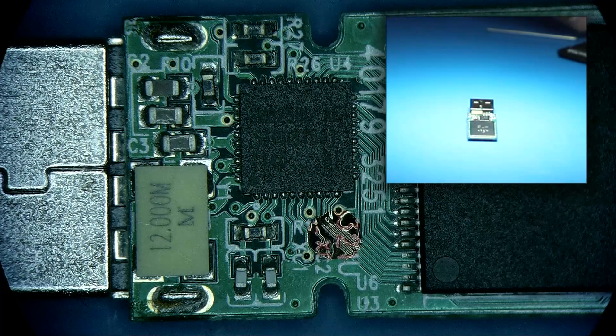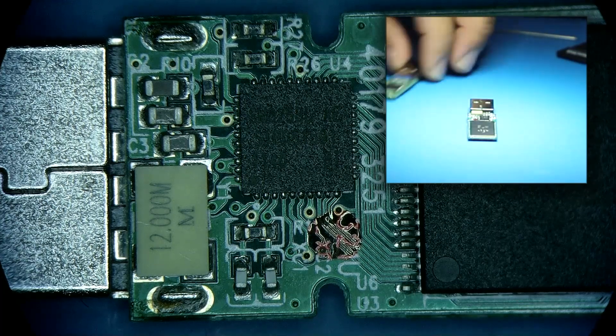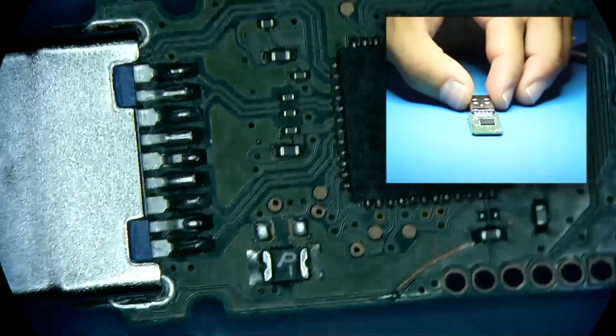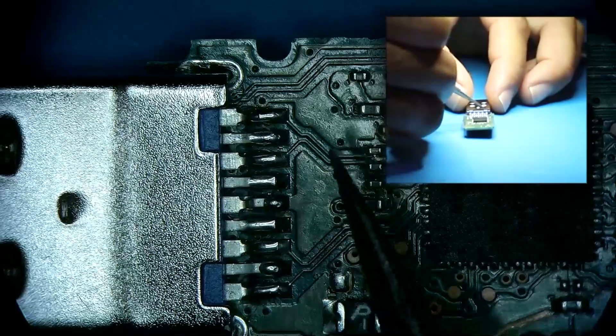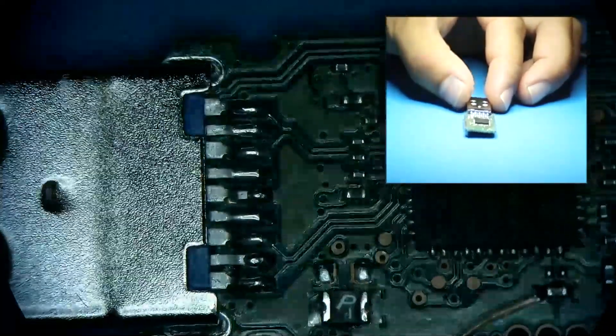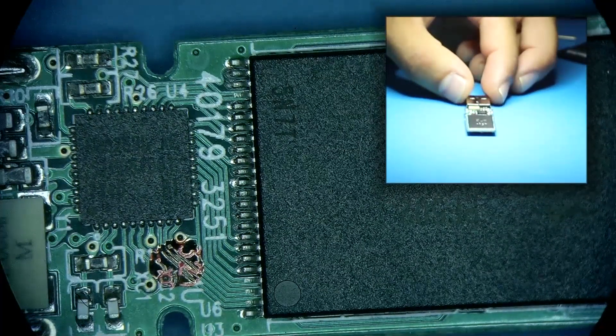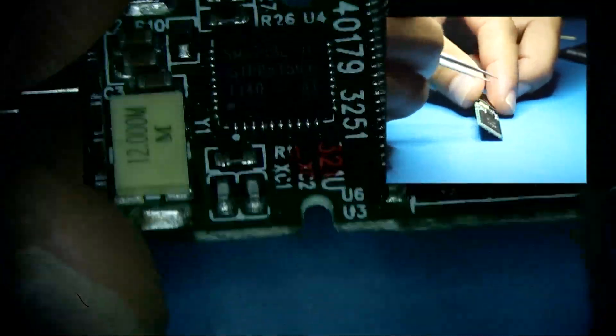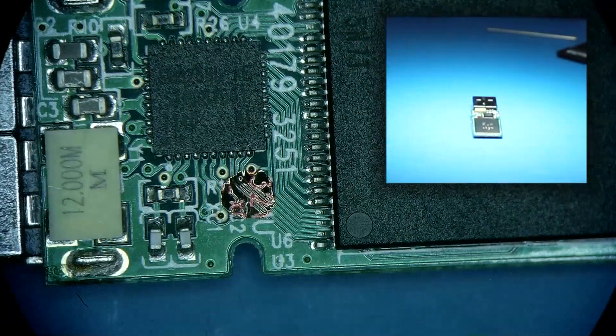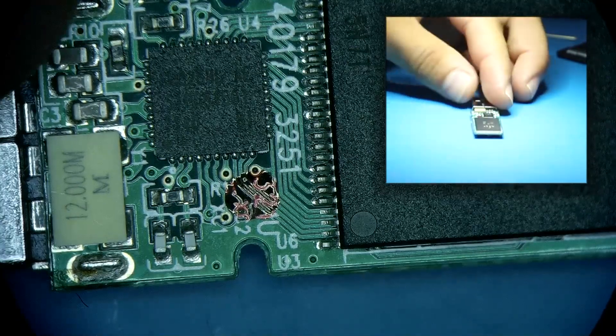If we compare it to what SanDisk does, we see the SanDisk has the cuts along the connector line — that's why broken connectors are a notorious failure for any SanDisk flash drive. But for Lexar, because these cuts are past the connector line, which is right here, it falls and lines up right with the controller, and often what we see is the controller has separation between the pads and therefore stops working.